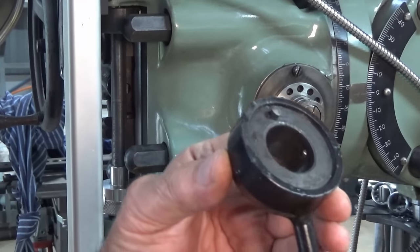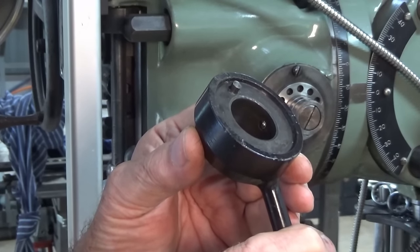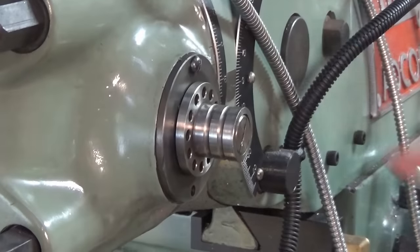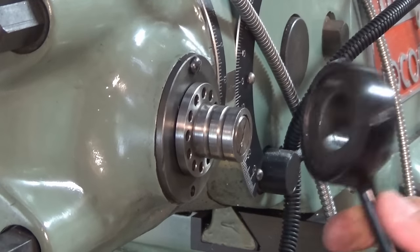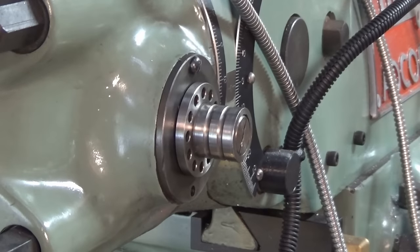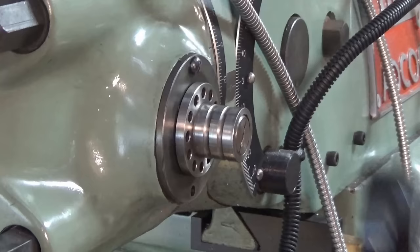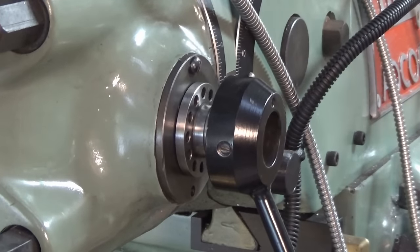Now also on the inside of the bore, there's a spring ball detent, and that ball can engage in one of the 2 grooves here. So you can see those 2 grooves there quite clearly, and when we fit the handle to the machine normally, it slides over like that, and you can push it on so the ball detent fits into this outermost groove here. And what that means is that the handle is held in place there, but it won't actually drive the quill at all.